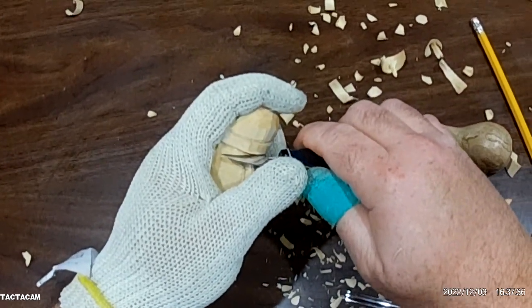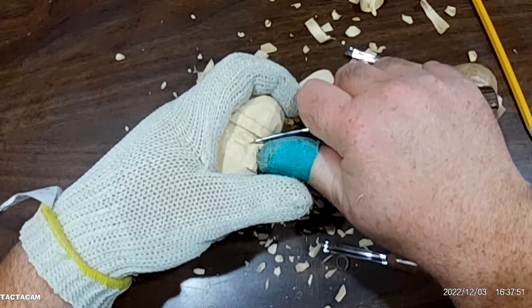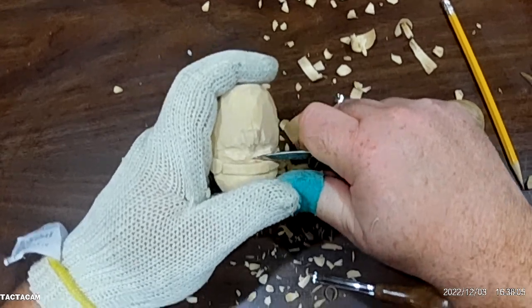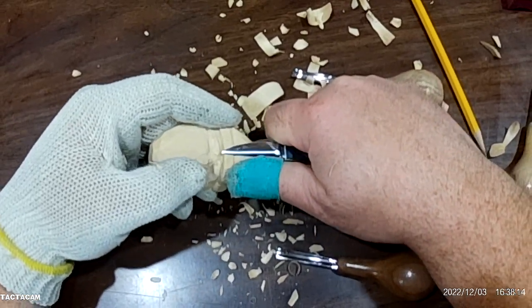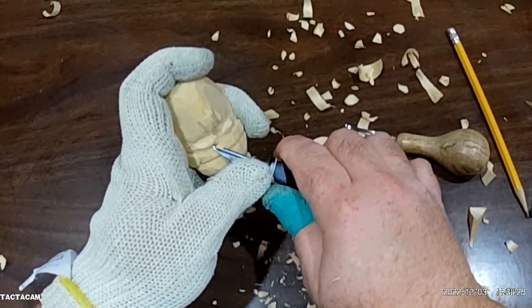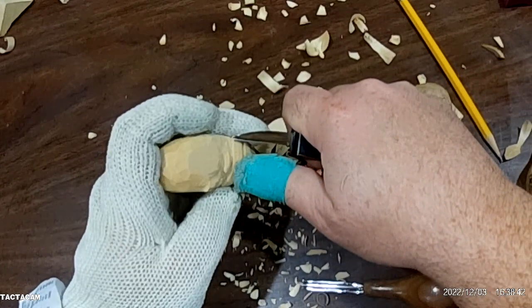I'll come over here and define the outside of the eyebrow on this side — take the rest down to the bottom of that groove. The eyebrow out here at the outside edge uses real tight short curved cuts. It'll get modified a little bit more as we go, just keep going around making little adjustments here and there. I also take a little bit more off of that brim — when I cut in above the eyebrows that brim ends up sticking out a little bit too far, so I'll take some of that off and soften the edge of it.